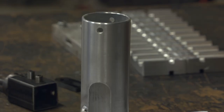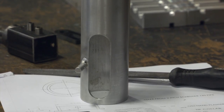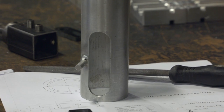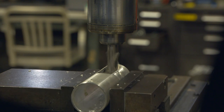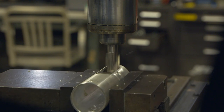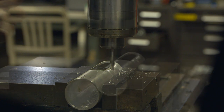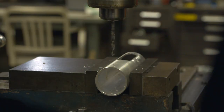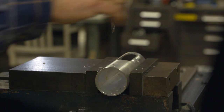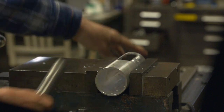The outer housing is the simplest part. Basically, put a one-inch slot in one end following the drawing dimensions. In that same setup, put a hole off to the side as a locator hole for the aluminum pin that will be placed there. Then on the same end, punch a quarter-inch hole all the way through both sides, three-eighths of an inch from the end.